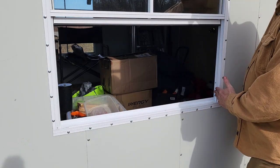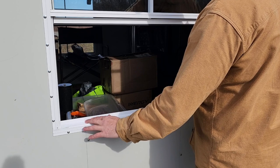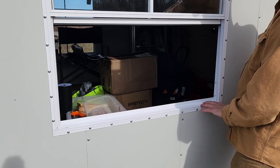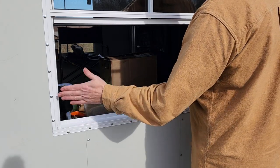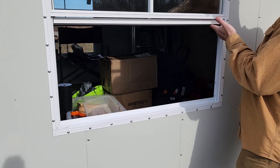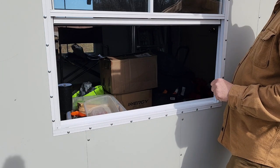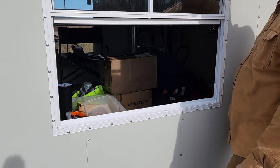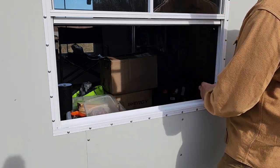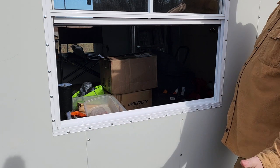What we want is that piece of wood to be the length of this sash here. You'll notice we've got this much higher lip — we want the wood up against that. And we also have a lower lip on the front. We won't actually be touching this, but this is typically what the screen sits in. We won't have the screen in, so we don't have to worry about that. The window also has a seal across the bottom; not all windows will. So some of that weather stripping that came with it could go on the top side. I want this to fit in here pretty tightly, so I don't know that I'll need the weather stripping all that much.